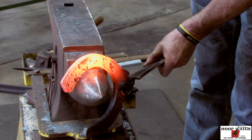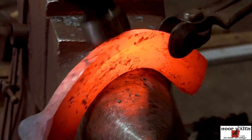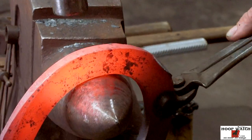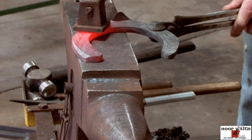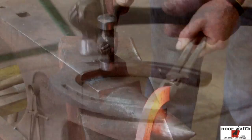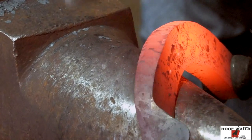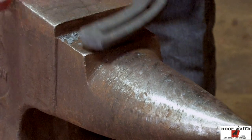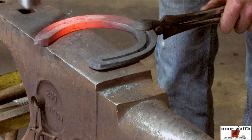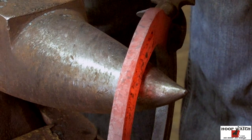I'm going out to the heel quarter and then staying behind the whole time because I'm taking that curve out of it. Go for my heel now. If I hold it here, I have my heel now. I'm just going to come in here — you can see the line I create and I'm going all the way up and right on through the toe clip. I find out where my heel nail is and now you can see my safing goes all the way through to the heel. They both work away from the quarter and it makes the transition line going from bevel to safe.